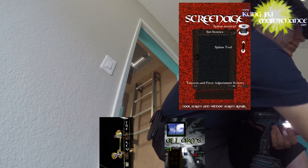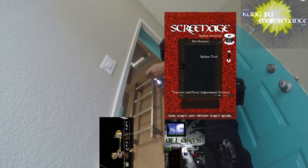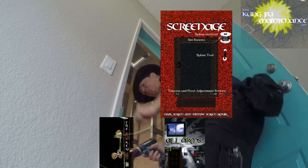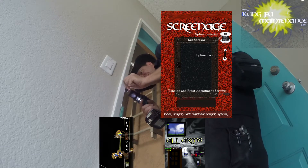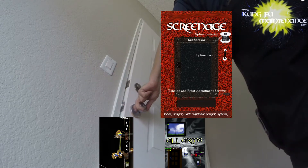I was doing a finish change on the deadbolt anyway and replacing the strike. What I'm doing here is setting — on this one I just set the bottom screw. It's kind of a strategy of then testing out what's going on. Is it hitting? This one was.